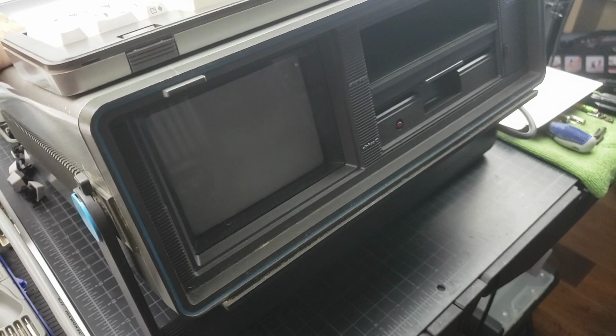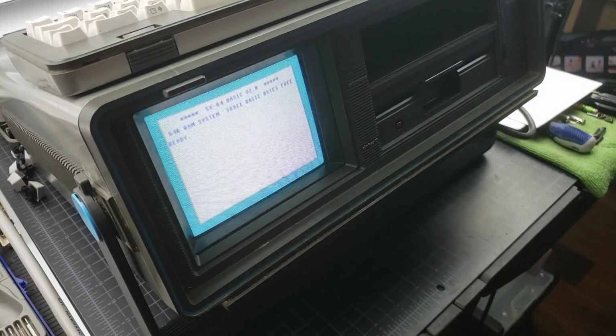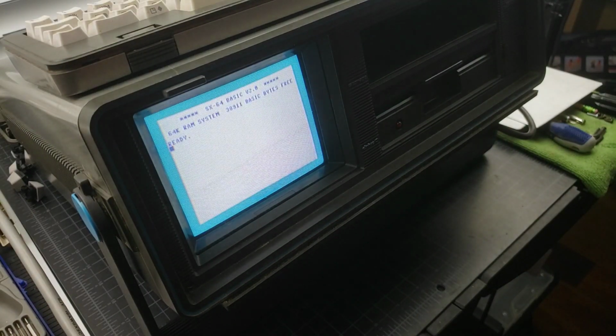Okay, so what we're going to do now is I'm going to dump the ROMs that are on these 1987 Jiffy DOS chips. So there's two ROMs for each chip. On the 1541, there's the ROM that's native, and then there's a ROM that is with Jiffy DOS. They're probably the same. And then there's the kernel ROM, which is the native one, and the Jiffy DOS one. The Jiffy DOS one, as you saw, is version 4.0. It was put out in 1987 by Mark Fellows.